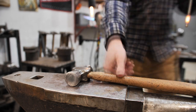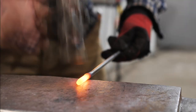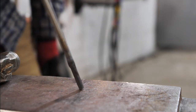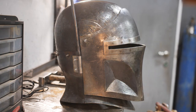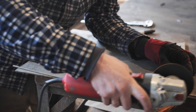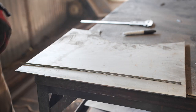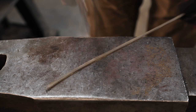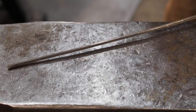Now I'm making the rod for the decoration. It should go in and out, so on the lower end there is an arrow part and a small bump. The rod is also stainless. I'm starting to work on the decoration. I cut off a strip 3mm thick and 4mm wide. I finish the cutting by removing the bars. With strikes of the hammer, I shape the textured surface of the detail. Now the surface is typical of forging by hand.